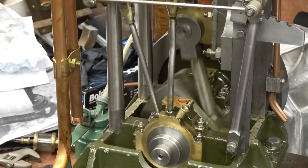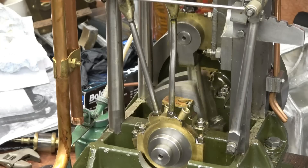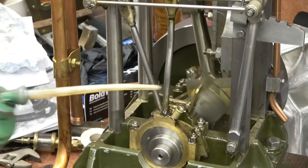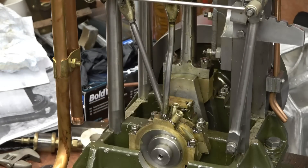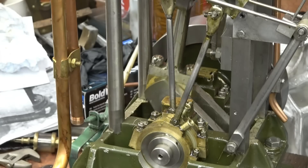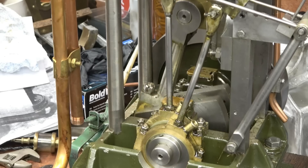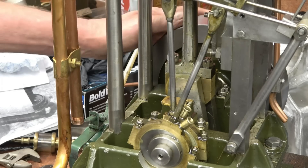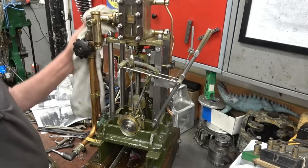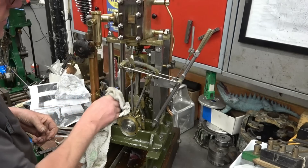The engine is now full of oil. These are the oilers for the main bearings — oil boxes, little oilers there on the eccentrics. Basically it's running on next to no steam pressure at all. Now it's just a case of a little bit of brake cleaner, wipe the thickest of the oil off and re-oil it, then it's ready to be used again which I think will be in three weeks time at the next steam rally — I'll get some film of it running on steam there.